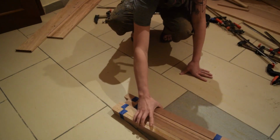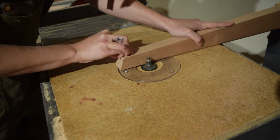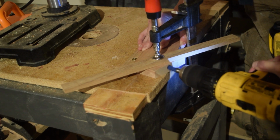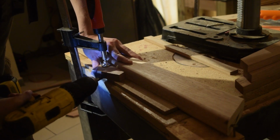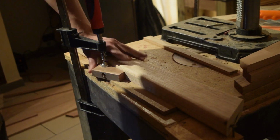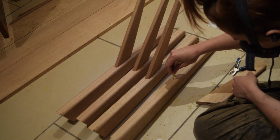With the first glue up complete, I rounded all 4 corners of both the long front legs and the short back legs. Using offcuts, I made a jig to hollow out the mortise for the dowel joint that would connect the short leg to the long leg. My jig created an angle for the dowel parallel to the floor in hopes that it will help keep the joint over time. Once the dowel mortises were cut, it was simply a matter of gluing them together.